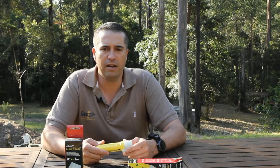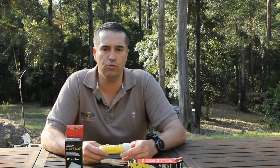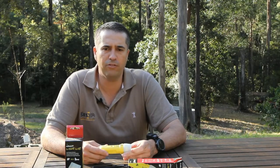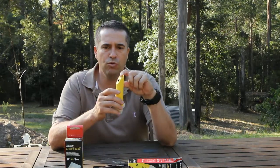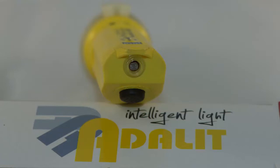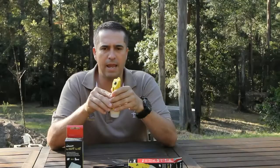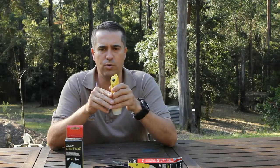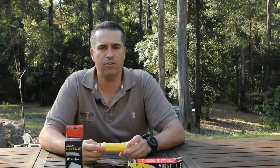This is a smart torch and has a few features not seen on normal torches. Inside there is a circuit board that controls all functions and communicates with a sensor on the base of the torch. The manual calls this the Intelligent Energy Management Sensor — simplified, it is a light sensor that determines the level of ambient light in the environment and can vary the intensity of the LED to make the batteries last a lot longer, up to 30 hours on the low setting.